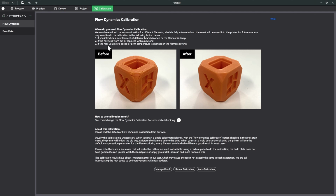If you've watched my channel before, and especially like the ludicrous mode video, I've made comments on this and several other filament calibration videos, but max volumetric speed is really how you can fine tune how fast your filament prints, because that is the thing that guides all of the other settings. And why I don't really mess with any of the other settings is because my max volumetric speed changes all of them in a proportional way. Or print temperature is changed. So if you change either one of those, volumetric speed or print temperature, then it's good to run this Flow Dynamics calibration again. Okay, we won't read the rest of this, and this shows a sample before and after.